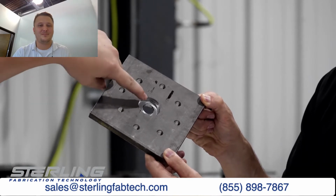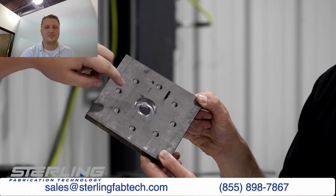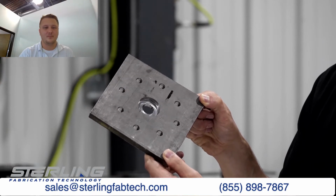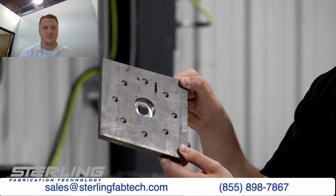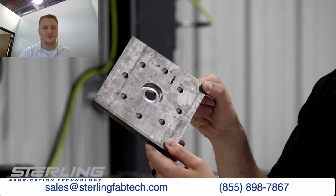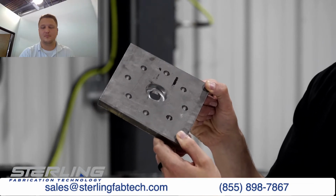And then I ran that 3/4 inch Allied Gen 3 drill in the center. And then the 3/4 inch Kyocera high feed mill to rough that material out for the counterbore, and then came back in with that 1/2 inch end mill, just to get it to size and make it look pretty. I finished it with that solid carbide end mill.